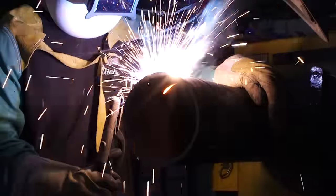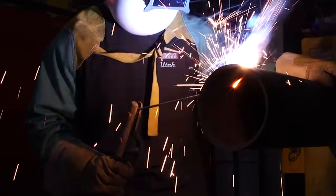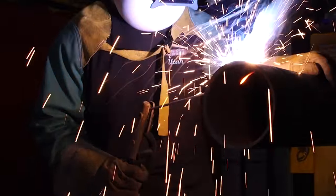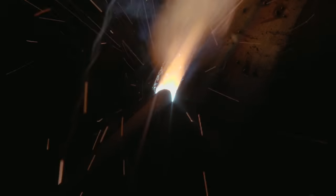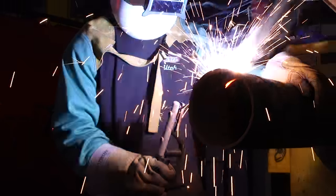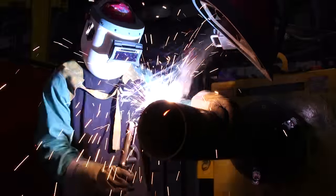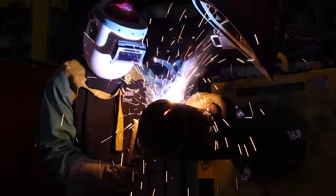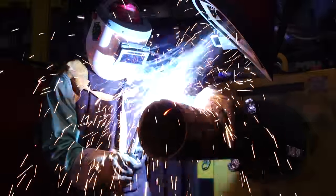You can see the root pass is a nice red. Now the funny thing with the 6010 hot pass — if you're doing a position weld, a heavy weld, you can't tell what your root pass looks like. You need to remove that flux somehow. The flux coating on the 6010 root: if you slightly grind into it and put 6010 over it, it will push the root in and also be easier to knock the flux off. If you put 7018 over that weld area, it'll caramelize your flux and it'll be very difficult to get the flux out if you're trying to visually inspect it, make sure you got a good tie-in or caught an edge — just a little trick.